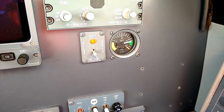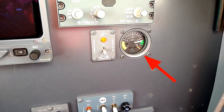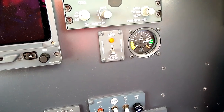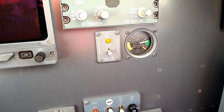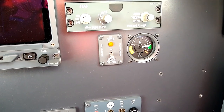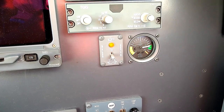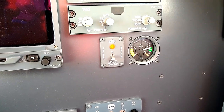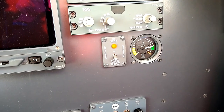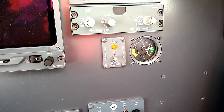Moving forward of the circuit breaker panel, we have the oxygen tank pressure gauge on the co-pilot side. It should show somewhere in the green arc, between about 1600 and 1800 PSI. The thing to remember is that pressure will vary with temperature — depending on what temperature it was when they filled the bottle versus current temperature, you'll see fluctuations. On a cold winter day below freezing, it's possible the O2 pressure has dropped below the green arc, but flying to Florida where it's 90 degrees and sitting on the ramp a few hours could easily bring it back up.